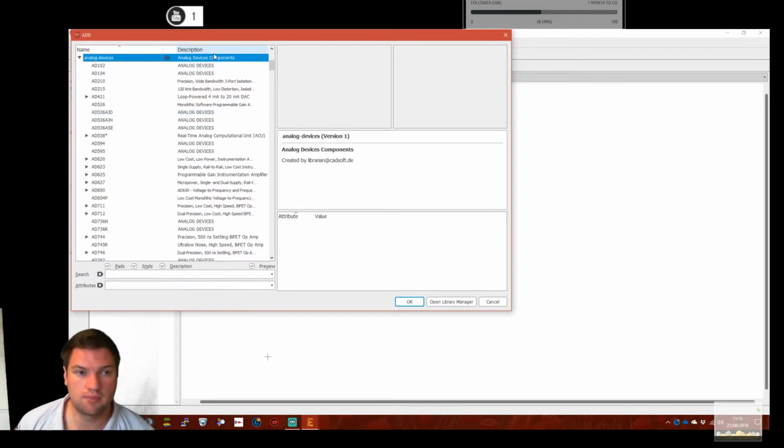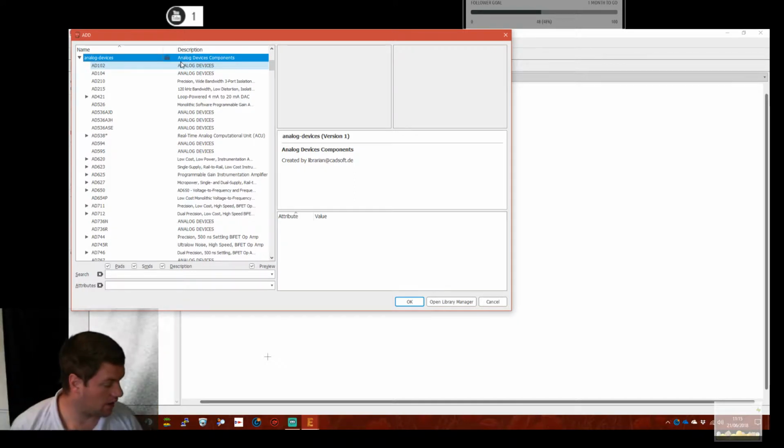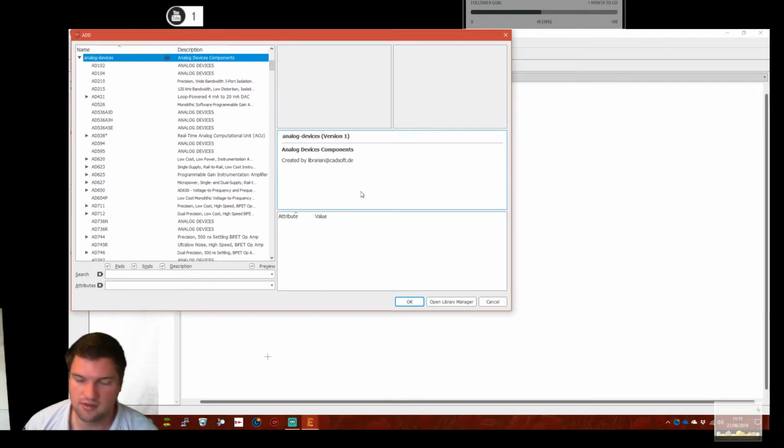So we need some sort of buck boost converter, so we can squeeze all the voltage out of the cap and therefore all of the energy. Now, unlike a lithium battery, we can discharge it all the way down to 0. A cap doesn't care about going to 0. In fact, some of them will even go negative, but you're not getting extra energy out of that. You can't overcharge them because they will go pop, but we can discharge them down to 0. So we want to get every last bit.